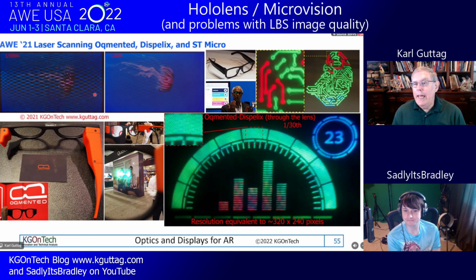Right. With 15 kilohertz. That was in some digits, but around 15 kilohertz was the horizontal scan frequency. Turns out if you take 50 kilohertz for the horizontal scan rate, and knowing how crapped up the scan process was, I knew the resolution couldn't be there. All you had to do is tell me that one number. And with 4th grade math, knowing how the thing worked, you can know it doesn't support the resolution that they claimed.